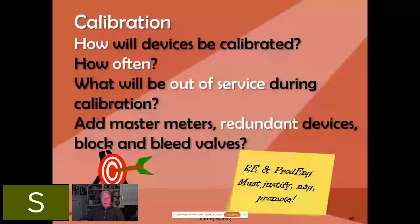If you have a meter that's full of debris and things, you don't know it from looking at it from the outside. In order to do work on that sort of meter or other kind of meters, you might have to do things like bleed an entire system down to pressure, shut the whole field in, in order to get at these devices to take them out of service, to calibrate them or whatever.